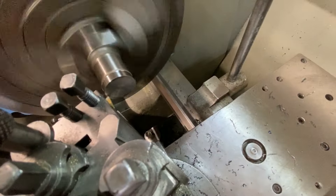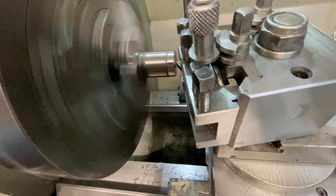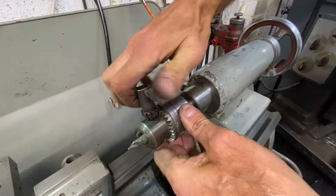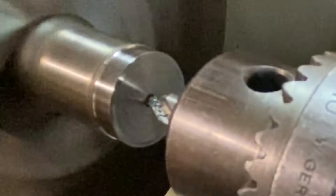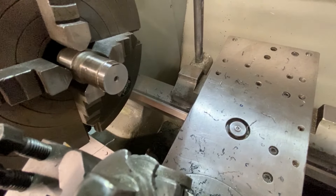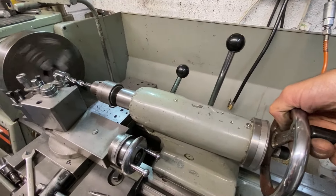Well, that's pretty good - I'm happy with that. With the portion of camshaft running true, I've put a carbide cutter in the tool post and face off the end. The camshaft's case hardened - it's very hard on the outer skin but softer in the centre. With the end surface faced off smooth, I set up a centre drill and drill the centre. I then drill a hole into the piece to a depth of about half the length of a gudgeon pin and slightly smaller so that I can bore it out accurately to a finished size.